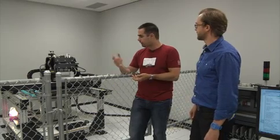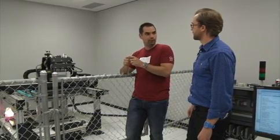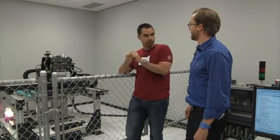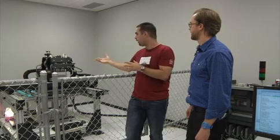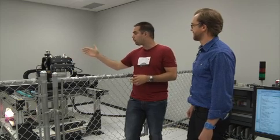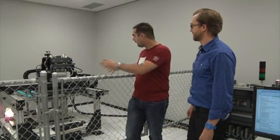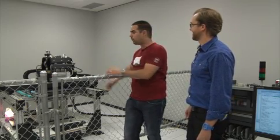One interesting story about this is before we had the gate, when we were building the unit, the limit switches I talked about that kill the motor, they hadn't tested those yet. So the first test of those were actually reversed. Oh, no. What that caused is the head of the unit thought that it was off to the end. And the way the robot works is it throws full power to the motors to correct itself. So when it thinks it's in the wrong spot, it threw full power to the motors and tried to go to the center. Well, that actually moved it all the way to the edge. There was no limit switch to stop it, so it actually hit. And this entire table that it's built upon, the head unit, everything moved. So what this required next was to bolt it into the concrete of the floor.